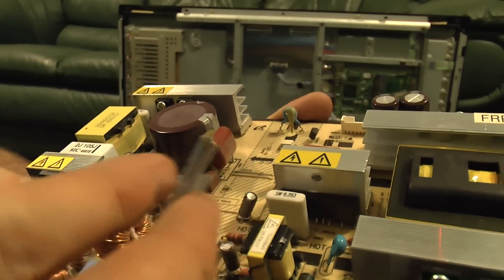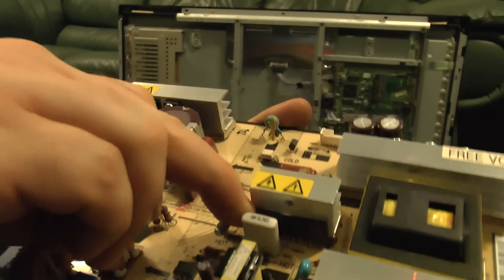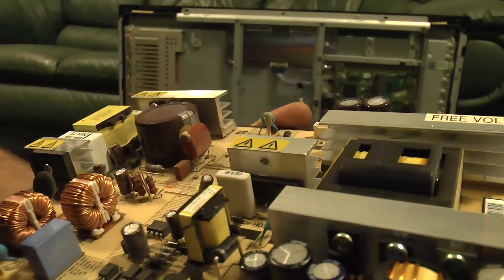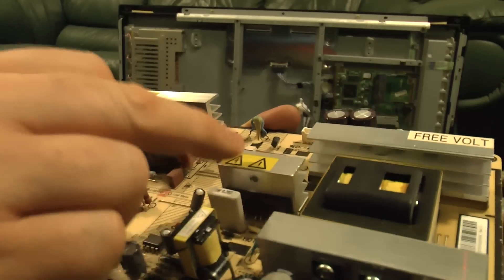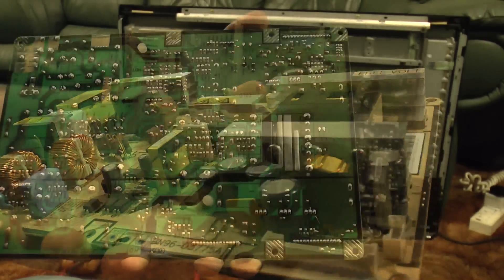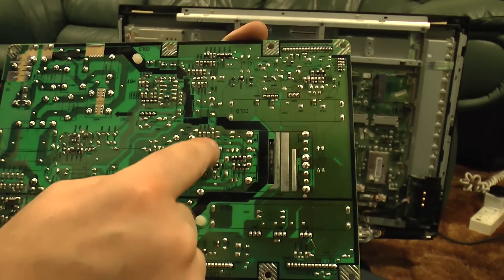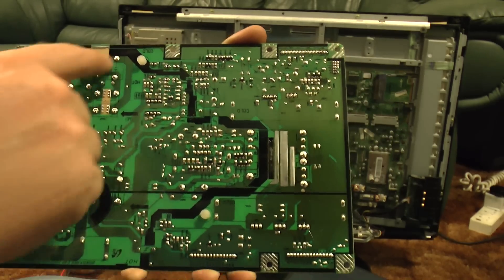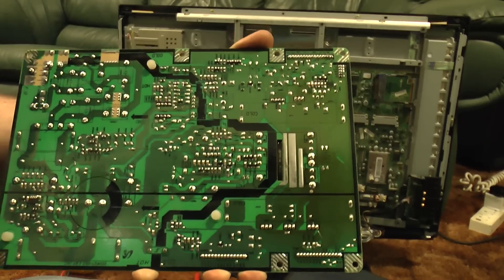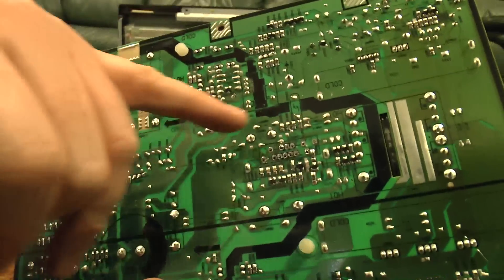Here's a close-up of the chip with the cover removed. It is bonded onto the heat sink — a little bit of heat sink compound, so you'll want to get some of that as well. The part number is F9222L, and like I said you can pick these up quite cheaply on eBay. Here it is on the bottom of the board in a zigzag in-line package with some pins removed. As you can see it's very much within the high-voltage side of the board.